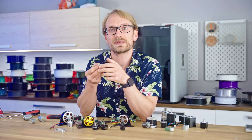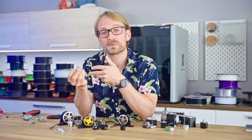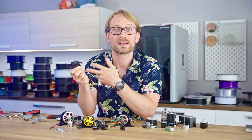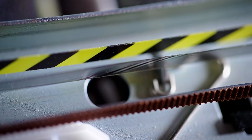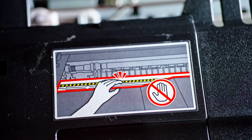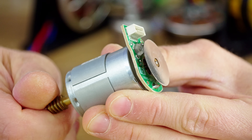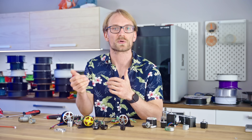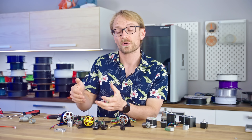But brushed motors have a quite limited lifetime, especially when you strain them with harsh direction changes like in a 3D printer, and because they typically can't deliver as much torque as a BLDC or stepper motors, applications like RC servos need to heavily gear them down, which introduces backlash. So not the best candidates for our application, but for something like an inkjet printer, they've become the default standard solution, combined with optical encoders — either those long strips of finely-graded transparent film labeled 'Do Not Touch,' or rotating types with an optical sensor attached directly to the motor itself. What turns a motor into a servo is just some way of getting positional feedback and then using that to adjust how the motor is driven — a closed-loop control system where the controller not only knows what it's putting into the motor, but also what is coming out of the motor.